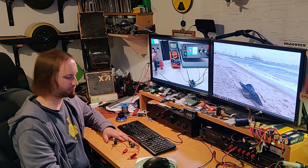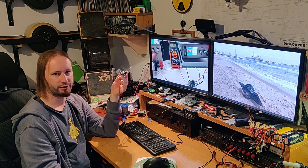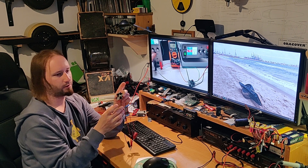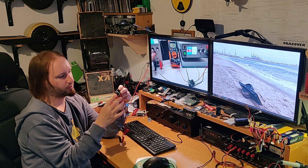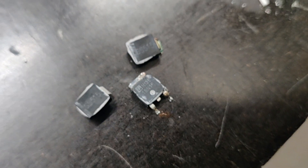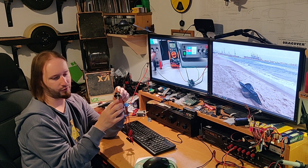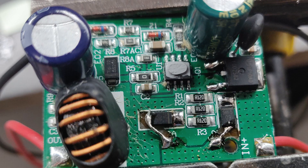Since I didn't finish all the tests and the second unit I ordered hadn't arrived yet, the only way to finish the test was to repair the bad module. The capacitor was not the only thing that needed replacing. Under the heatsink there's a MOSFET, two diodes, and a chip. The MOSFET was broken, and since the diodes were glued to the heatsink very well, while pulling it off I damaged both diodes and a little bit of the PCB. I ended up replacing the MOSFET, the two diodes, and made two bridges across the damaged PCB just to patch it up.